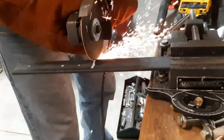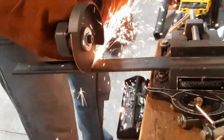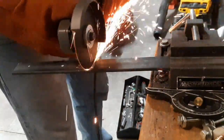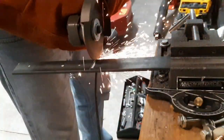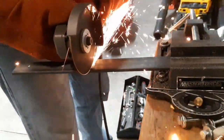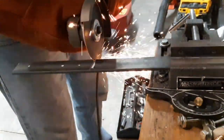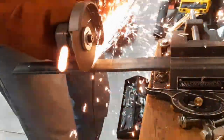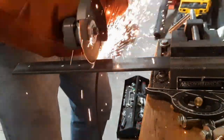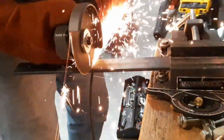This piece I'm cutting right now with the angle grinder — enjoy this nice little slow motion shot — was actually supposed to be one of the metal rods going for the wheels, but I ended up changing my mind on the wheels, which I'll address later in this video. That's why you see the little three white dots on that piece of angle metal I'm cutting off. Anyways, this is actually going to get welded onto the hitch. In this next clip after the slow motion you'll see exactly what I'm talking about — it gets welded onto the hitch and the angle piece I was previously drilling, and it'll connect them and make it one sturdy piece.